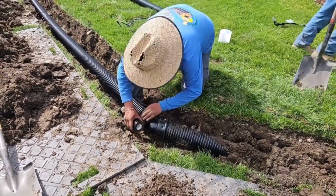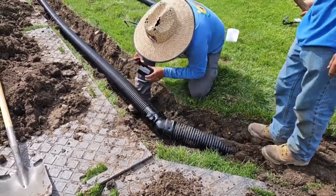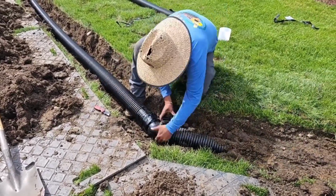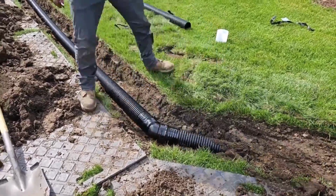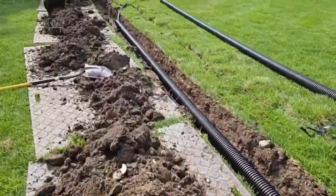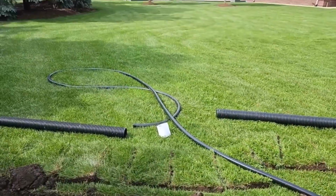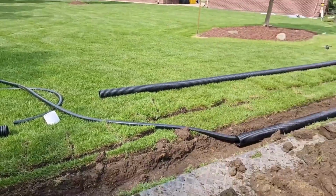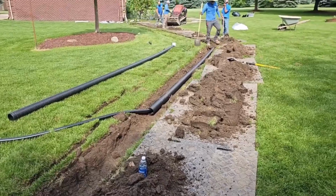100 feet of continuous pipe, no leaks, don't have to worry about anything. But you have to lay it in a sleeve. Now, I prefer to go PVC free any chance I can. So we're using dual wall culvert pipe, a 4-inch dual wall pipe for our sleeve. You can use 3-inch Schedule 40 for this 1.5 inch flex if you want.